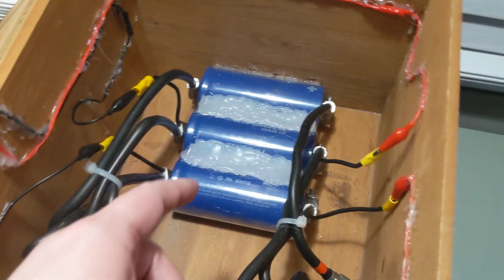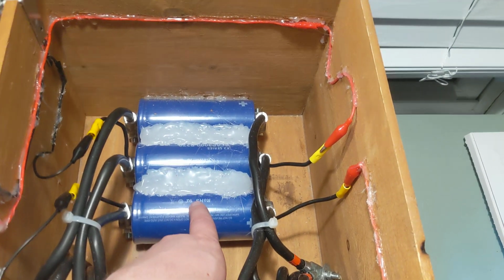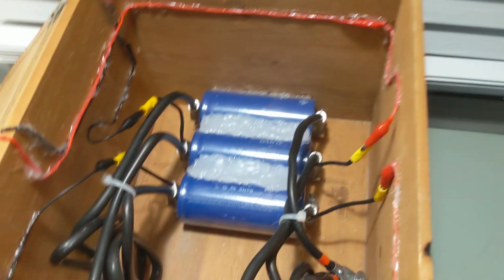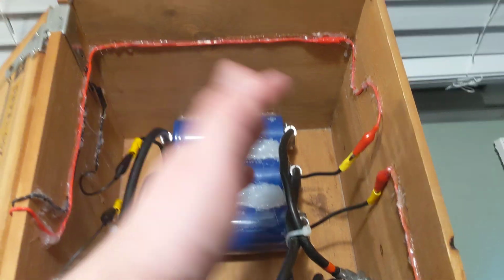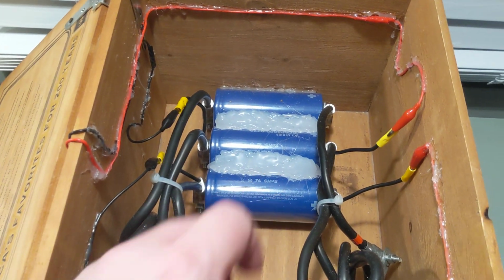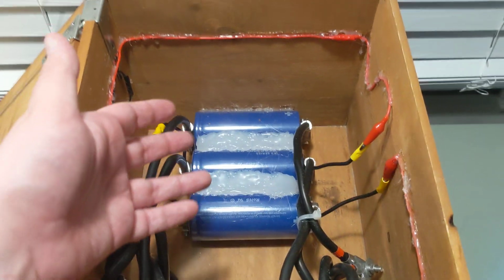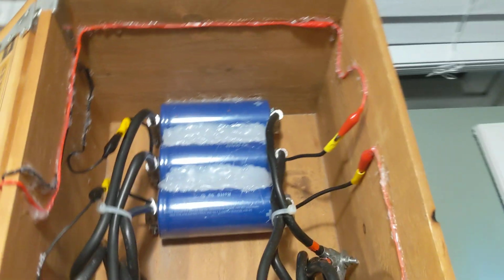But the point is that voltage has to stay below 80% of the rated maximum of 2.7 volts for these capacitors, because that will keep their lifetime at 300 years. So you wire these in parallel instead of in series, because putting them in series, you have to use load balancing, which keeps each individual capacitor from going above its maximum or going negative as they discharge or as they are charging. Now, in order to do a load balancing system like that, you need to have some circuitry that constantly is monitoring the voltage in each cell, and then it uses that power to readjust the voltages between them and balance it out. But if you do that, it wastes the power. Well, so sort of wastes, it uses the power.